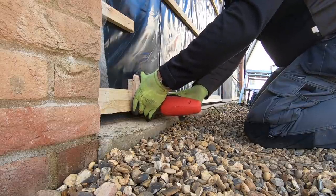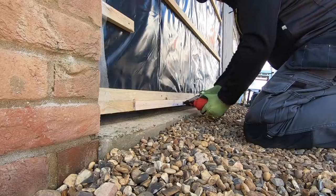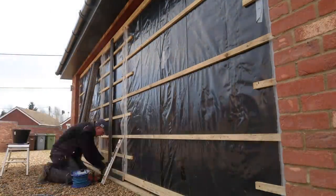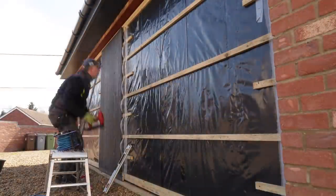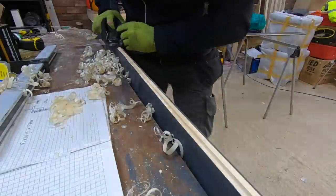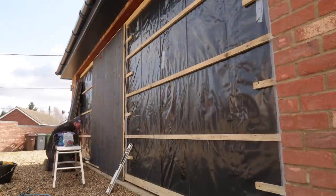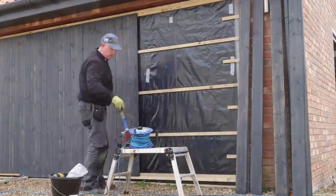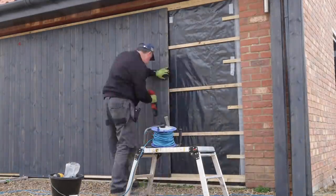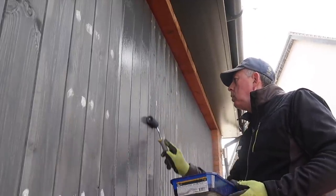To help install the boards and to keep them at a constant level, I fixed a temporary batten accurately at the bottom so they could sit on it as I pinned them in place. Around the centre door, I fixed the boards so an even number of boards was slightly wider than the opening so when the door was taken off the cladding would come with it. At the interface between the door and the rest of the wall, I removed the tongue from the boards either side and just butted them up to the adjacent boards, which means they look consistent but there's no actual tongue and groove connection between them. I used an electric brad nailer to pin the cladding into the battens with 50mm stainless steel brads. The rest of the cladding went on fairly easily, although I was always trying to keep in front of the impending rain, which caught up with me in the end just as I was giving the cladding another coat of paint.